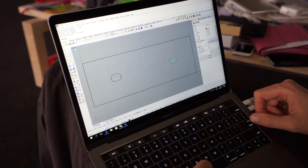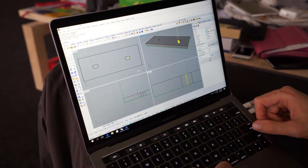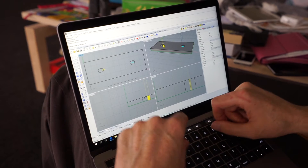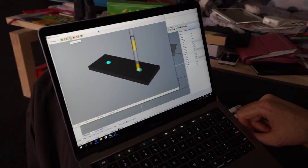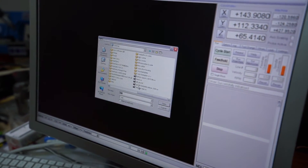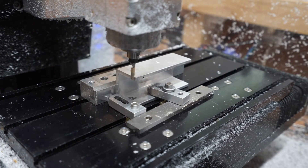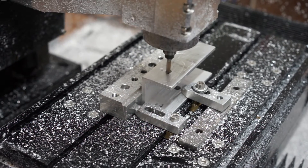Next up we needed two holes in the feet, and we decided to make these lozenge-shaped. Simply because the chance of me getting everything lined up in exactly the right places is almost none. Making lozenge shapes means we can move the feet side to side and get the positions exactly right. We're going to use Jason's CNC machine for this — this is the software he uses to pre-plan what the CNC machine is going to do. Jason loaded up the program he designed to drill the holes, zeroed the machine so it knows the starting point, and then we let it do its magic — and man, it is magic.